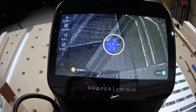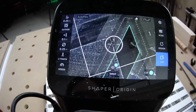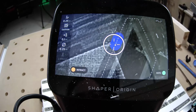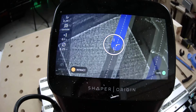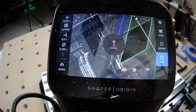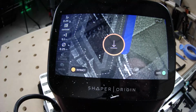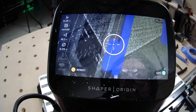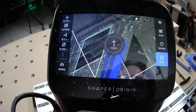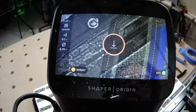All right, so we're doing these outside cuts. We do need to start with that 0.1-inch offset to make sure that we clear out all the material between these 2 dovetail slots here. So Jake's going to take some time to do that. We're going down to a 1/4-inch depth first, and then we'll take this down to a 1/2-inch depth, and then we can take that offset all the way off, so that we're bringing that into the top of this dovetail cut that we're about to make.